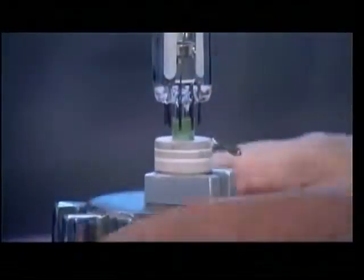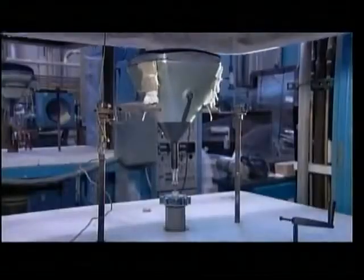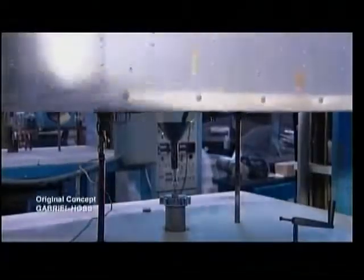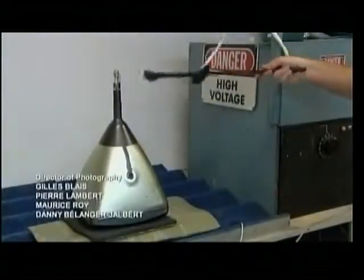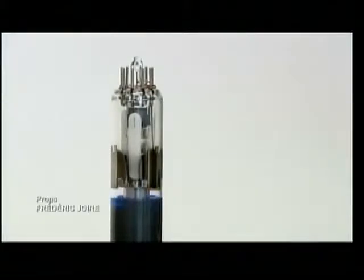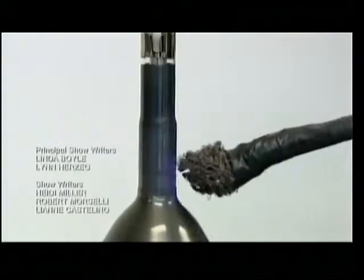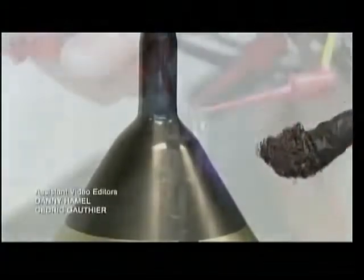This ceramic heating coil melts a green glass pellet to keep the bulb under vacuum. The tube is heated to 750 degrees Fahrenheit for two hours, and once again a vacuum is drawn. To minimize image flicker over the tube's lifespan, workers condition the bulb using a high-voltage coil, which smooths any rough surfaces that might remain on the electron gun.